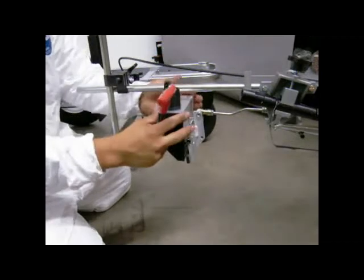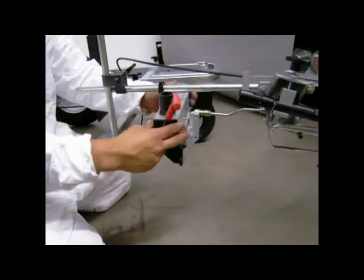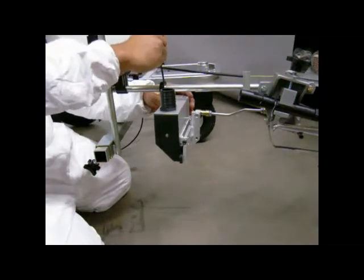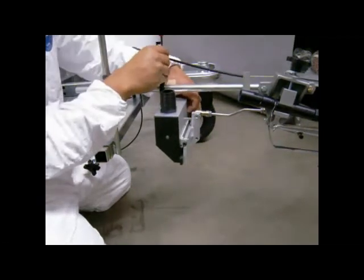If the door is in the open position after tightening, you will need to loosen the cap screws and shift the dispenser backward until the door remains closed.